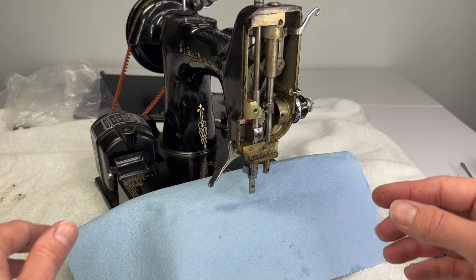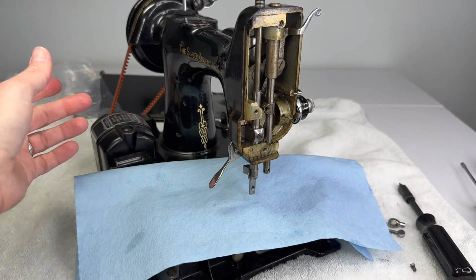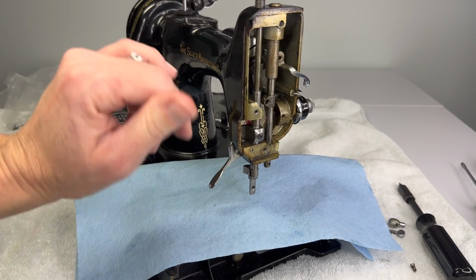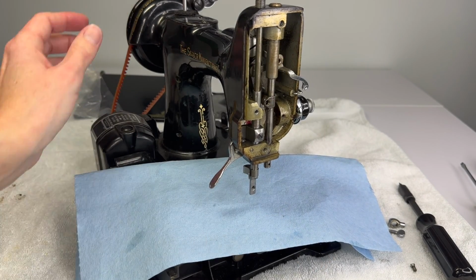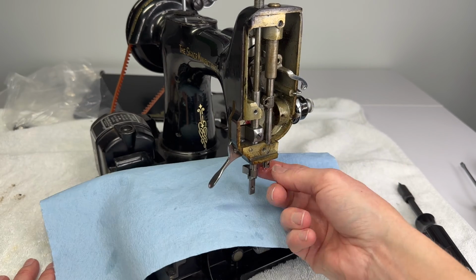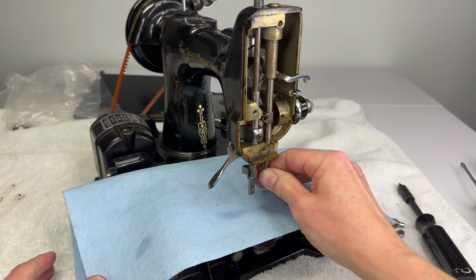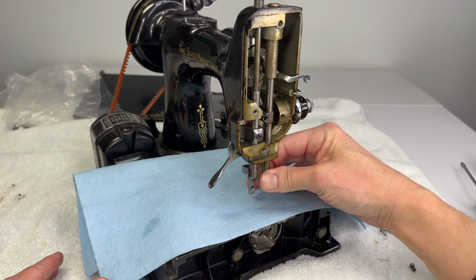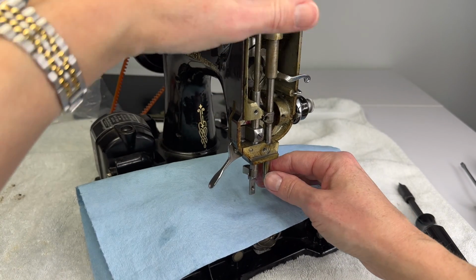Now let's look at our needle bar. The needle bar is probably going to be pretty stuck. And by turning my hand wheel, I see that it moves inside the bearing here and down through this hole out the bottom of the machine. It's not really moving left or right. I can't twist it. And, oh, there we go. So I'm just grabbing the bottom of the needle bar with my fingers and seeing if I can turn it and get it to free up, because I want it to move pretty freely before I try to slide it out of the hole here in the top.